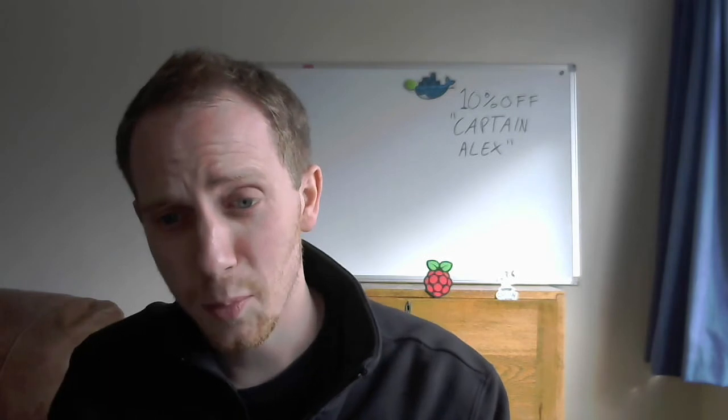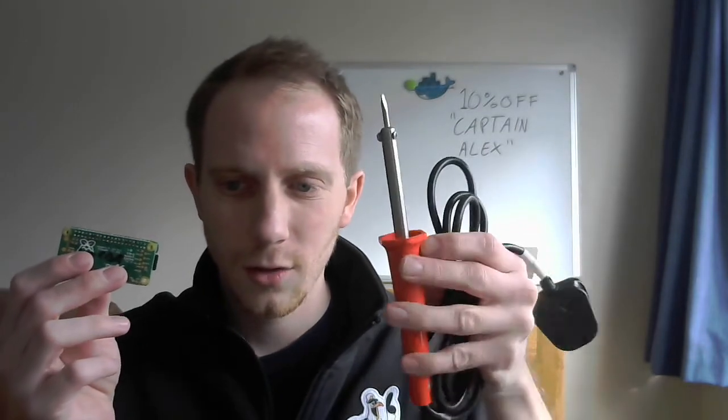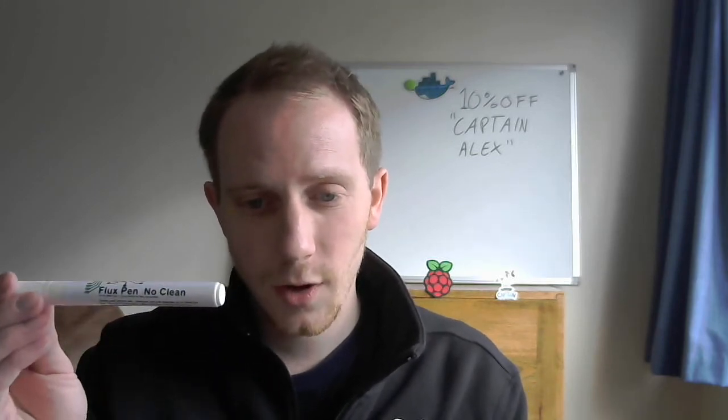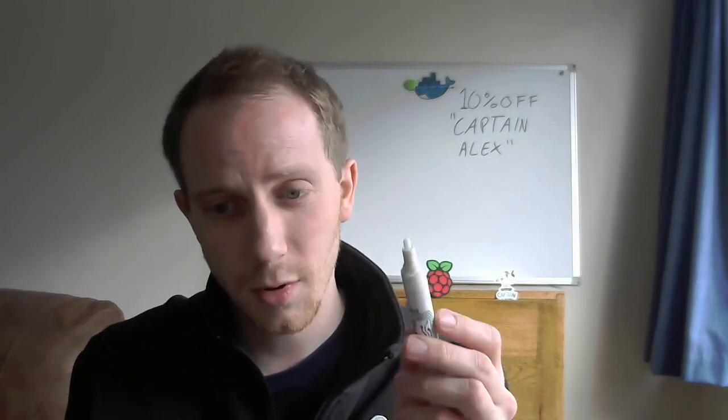First I want to share a couple of tips around soldering. Once you've attached your pins to your Raspberry Pi, you use a soldering iron to make each joint permanent. This is the kind of solder that I buy, which is a 50-50 mix of lead and tin. If you want to make your joints really solid and durable, the thing that really helps is a flux pen. Flux is a liquid which you apply to each joint before heating it up, and it helps the solder join really well.